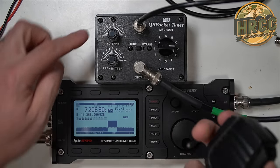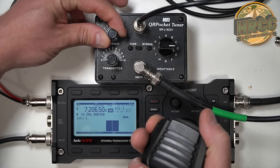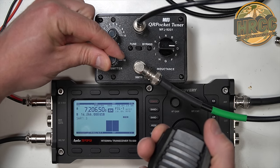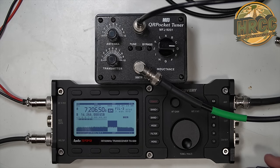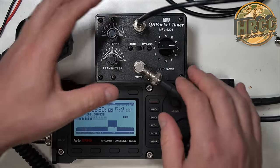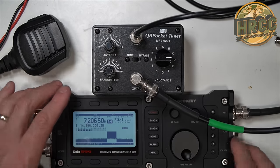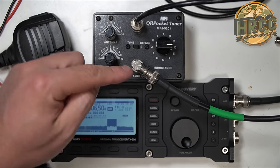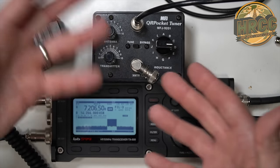But let's fine tune it. I'm not going to mess with the antenna — I'll show you what it looks like. So at 1.8, watch what happens when I adjust the antenna: SWR climbs. We don't want to do that. Instead, let's go to the transmitter and adjust it — and it's dropping. Right there: 1.1, 1.1, 1.2 to 1. We just tuned the antenna. Well, let me be specific — we're not tuning the antenna. We're not tuning anything. This box is creating a match between the mismatch of the antenna and the 50 ohms that this radio expects. It just creates a 50-ohm impedance so that the radio can put out all its power into this box and have it go out of the antenna. That's really what it's doing.